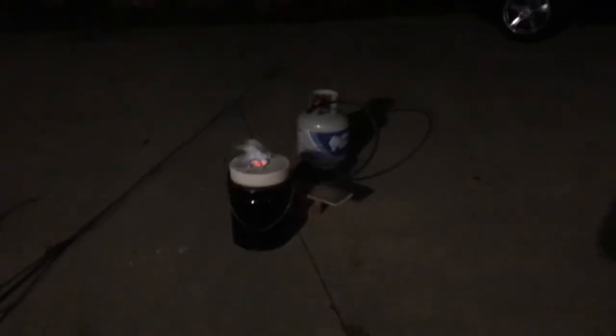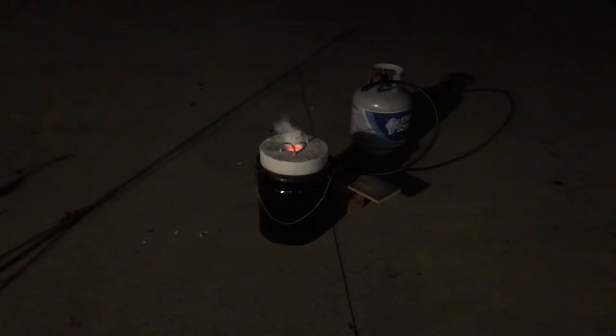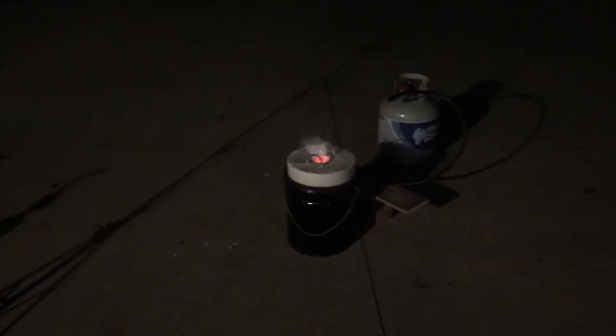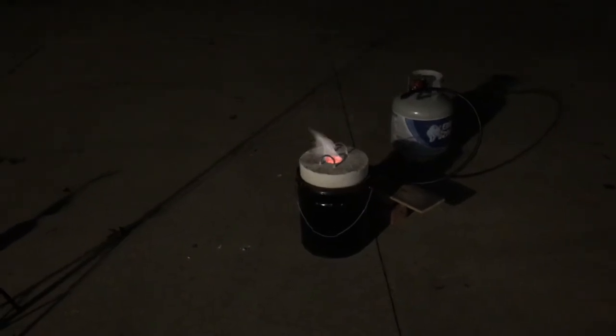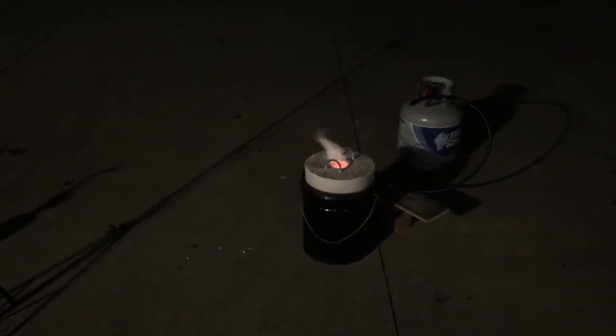Now, one of the reasons I said you need excess carbon, and I did far and above what is actually probably needed, is the more alloy content in the iron, or the higher carbon, the lower the melting point is. So pure iron, I really couldn't melt in my forge, but the very, very high carbon, probably 5% plus carbon that'll be coming out of here is doable. I believe it's like 2300-2400 degrees F, as compared to the 2800 of wrought iron, which would be pure iron.